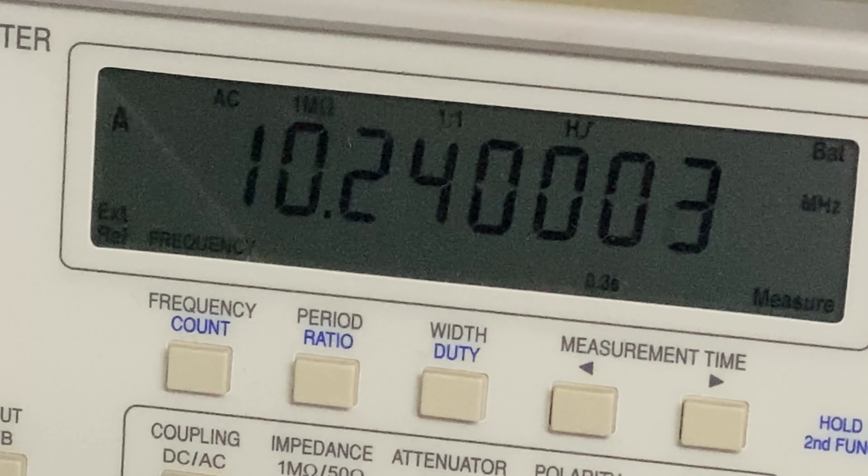There's the radio. Push button to your favourite channels which are already preset, and then going all the way through — everything on the display showing correctly, the modes, RX and TX. The low/mid/high has been repurposed for plus and minus 5 KC, and everything else has just been left the same. The radio's still got good functionality — every switch works.